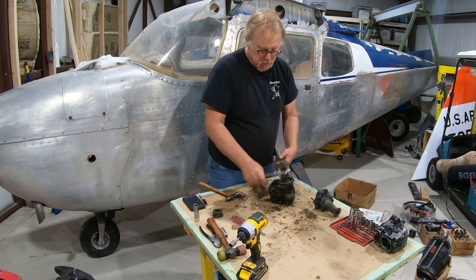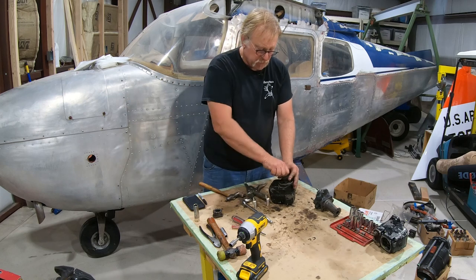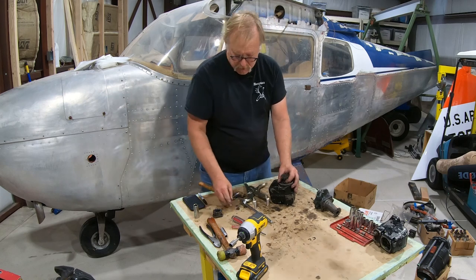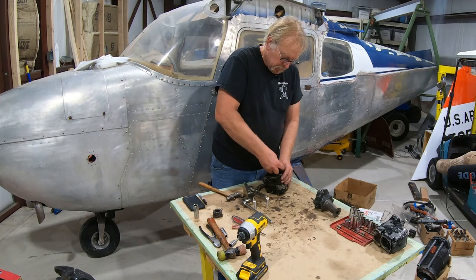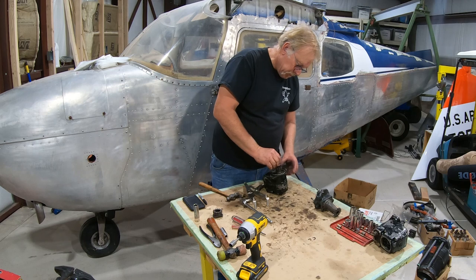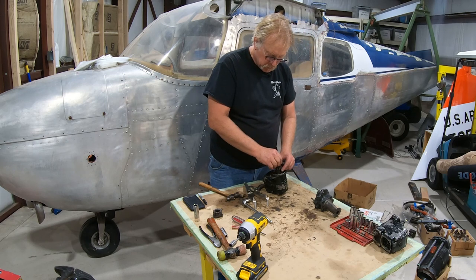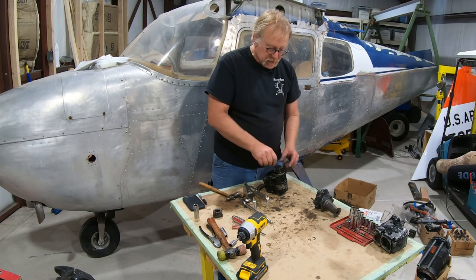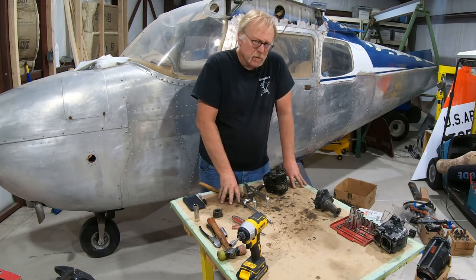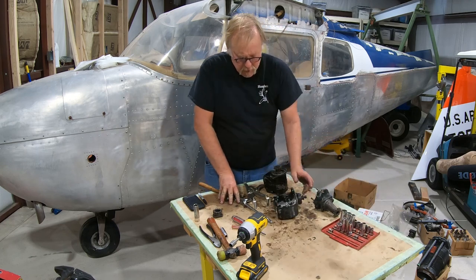These gears also get a lot of varnish on them. So if you do take them out for a 500-hour inspection, clean the gears, make sure everything's clean that way. And then, let's see if this thing will give it up. Oh, this one, we're gonna have to put the puller on because it's on a taper. So we're just gonna leave this one be for now. That's about it, tearing stuff apart. I hate to use that term, disassembling it for machine shop work.